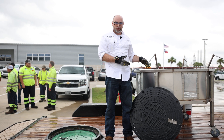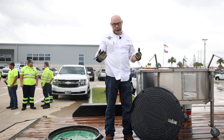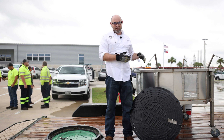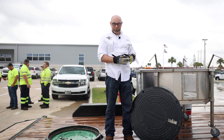The test we just conducted in our stainless steel water box manhole cover test is basically to yield a GPM — gallons per minute — which is the rate at which things leak. The particular manhole cover, which is a standard manhole cover for the city of Galveston and a lot of people in Texas, was leaking at 60 gallons a minute.